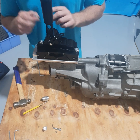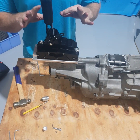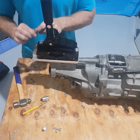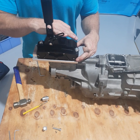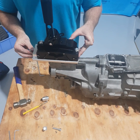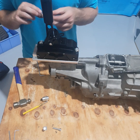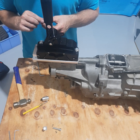The most important step that a lot of people skip but is absolutely necessary: once you know this is in the right position, you've got to drill some holes in the back here and fit these roll pins. This will stop it all shuffling around under hard use. If you leave it without the roll pins and go out and thrash it, it will move a little bit and jam up. So make sure you fit these roll pins — it also makes it really easy if you have to pull it off, as it goes straight back on where the roll pins are.